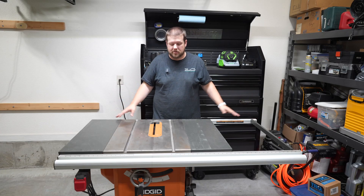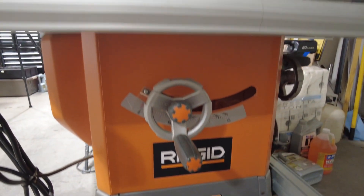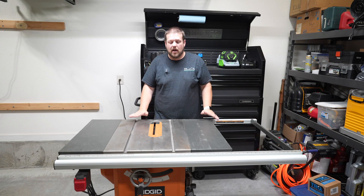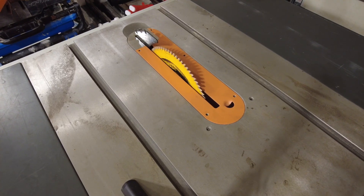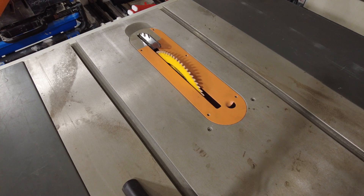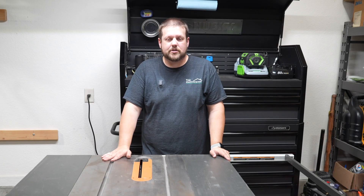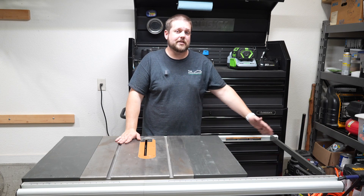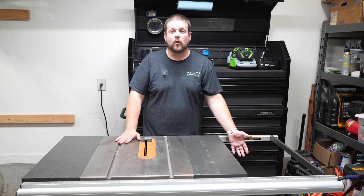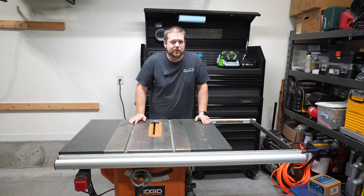The next pick is a table saw. If you're going to be doing a lot of construction work like building furniture where you need really straight cuts, I highly recommend picking up a table saw. You don't have to get a large one like this with a cast iron top — a portable table saw will also save you space and budget. If you do go with a larger table saw, you can add an extension to mount a router underneath it, which gives you more consistent results and is a bit easier to use.